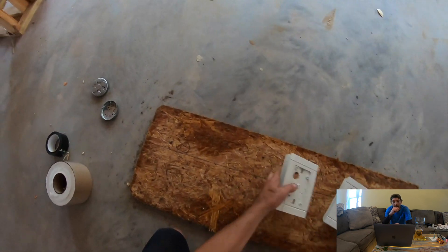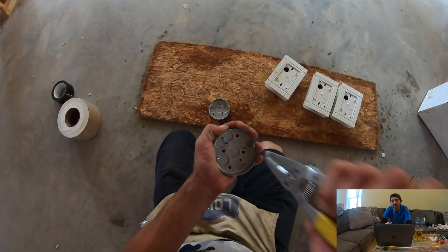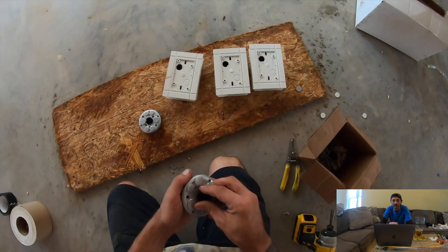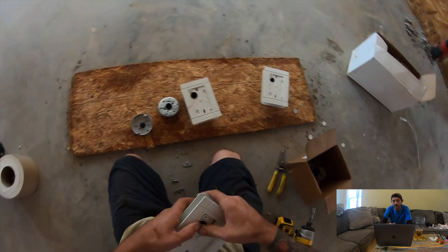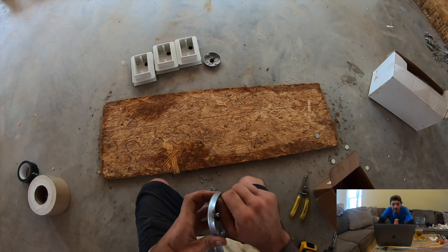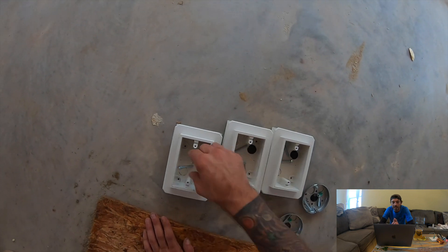I have two three-and-a-quarter pancakes and those are going to be for the coach lights on the garage. I'm just taking out these extra screws that I don't need because I won't use those pressure connectors. Taking out the half-inch knockouts and I have the grommets for those too. I'm prepping everything in one station because prep is everything in construction. I'm putting them together and putting the ground screws in the three-and-a-quarter pancakes — you need a ground screw for any kind of metal box. Then I'm using 5/16 hex head screws, inch and a half long, just making sure I have enough for all of them.